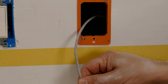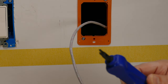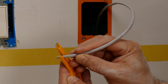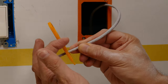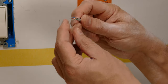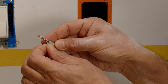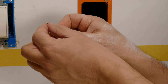Now let's connect the keystone jack to it. First we strip off some of the outer shell using the stripping tool — find the hole that matches the cable size, it just fits right to the blade. Push the button down, get the cable in place giving it about an inch and a half, let it lie in there, and just turn it a few times until it loosens up. Click it again to open it. Now the outer shield should be good. You'll notice there's a nylon cord — or sometimes stainless steel cord — inside. You can pull on this to remove more of the plastic if needed, so don't cut it right away in case you make a mistake.